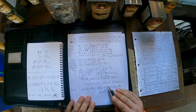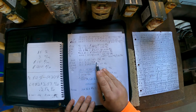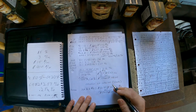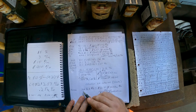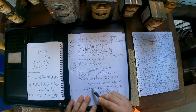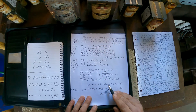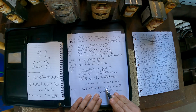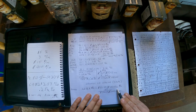So operating at that capacity, you take your units per minute from the slowest machine, 3.66, because everybody's going to be waiting on that guy. And that's going to be your overall average of what your production rate is. So if we take the 3.66 units per minute, you times it by your profit per unit up here, 609 or 942, you come to $22.28 per minute profit, or $34.47 if you're getting them for free.